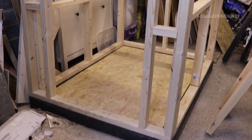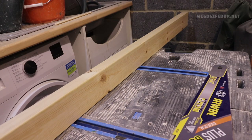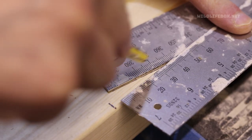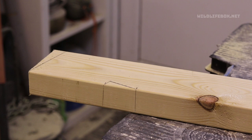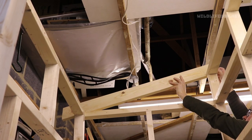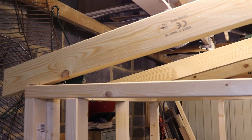I then created the roof rafters which will support the roof. To do this I used some slightly thicker CLS timber. I measured and cut this to the right size according to my plans. I then used an angle measure to create what's appropriately called a bird's mouth cut — this is essentially a cut that will allow the rafter to fit neatly on the top timbers of the bird hide. You can see details of the specific angles I used to measure these cuts in the bird hide plans. I then placed the rafters on the sides of the bird hide to form the top of the roof — they should fit neatly — and again we'll drill these in.